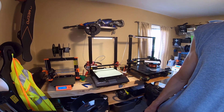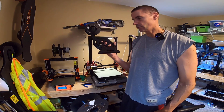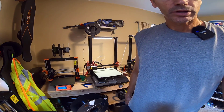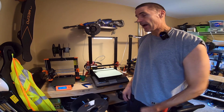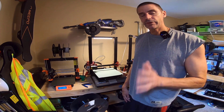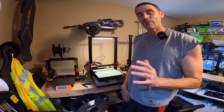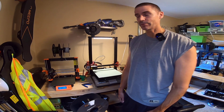It's fixed. Works great now. Just did a couple of parts — 12 to 13-hour prints — and both of them worked totally fine, no problem. So I feel safe saying the problem is fixed. If you have a printer that is under-extruding mysteriously, make sure your nozzle is tightened all the way into the heat block. That's all I can tell you. It would have saved me a boatload of frustration and troubleshooting.